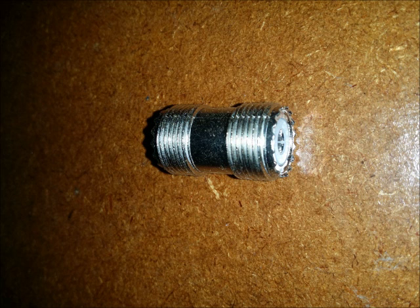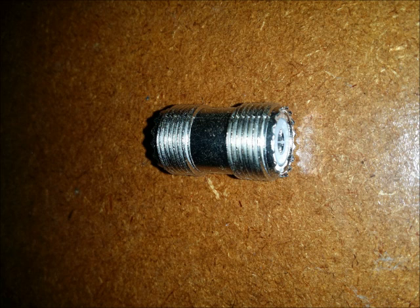The next task was to actually make the connector so that the diamond antenna is able to screw onto it. So what I did is I took one of these RF connectors that were male to male, and I took a pipe cutter and I cut it in the middle. As you cut it in the middle, it actually separates into two separate plastic pieces with the metal connection point in the middle. I just took one of these plastic pieces and used it in the one half that I cut.